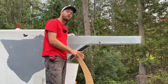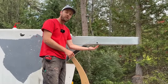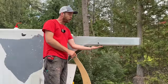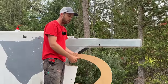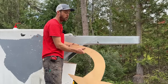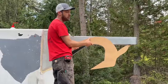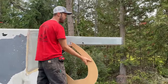So you'll notice there's a few things different from the original designs, the biggest one being that there's no anchor channel cheeks hanging down below where the anchor roller is. What I did is I pushed the anchor roller further up. Steve, the anchor guy, was talking about how these Vulcan anchors tend to wobble around a lot. And so what I wanted to do was get the most forward end of the fluke to basically bang up against the underside of the sprit. And that would be one of the things that would hold it in place, to keep it from wobbling.